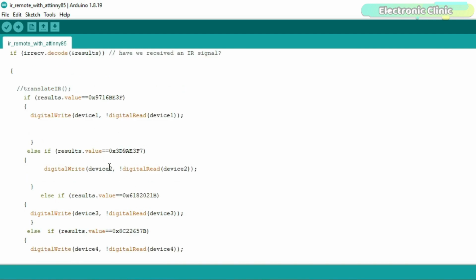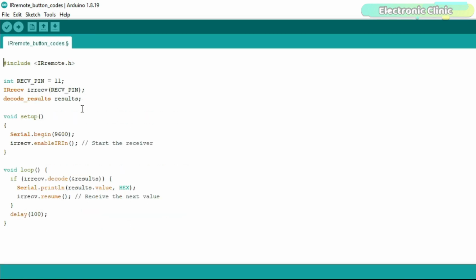Well, I have been using IR remote controller with Arduino and other controller boards, so I simply copied these codes from my previous projects. I have added links in the description if you want to learn how to find the IR remote control button codes. Or you can use this simple program. All you need is to connect the signal wire of your IR sensor to the Arduino pin 11 and of course the voltage pin to 5 volt and ground pin to the ground pin.